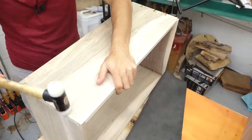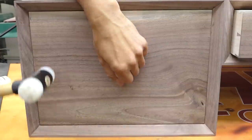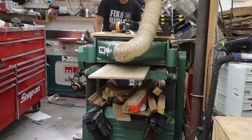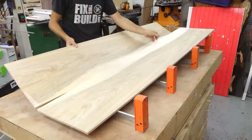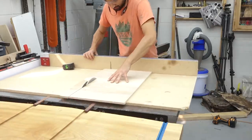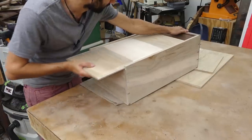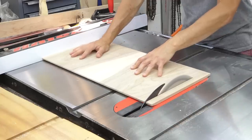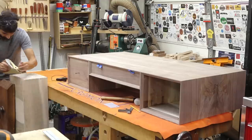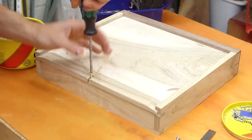Let's go ahead and glue these things up next. I'll get the glue applied and the drawer reassembled, and I can use the case as a clamping form so I can rack the drawer so the front ends up nice and parallel to the front of the case. Once the glue sets, I can pull the drawer and flush up the joinery. Next, I'll work on adding the bottoms. This starts by gluing up the panel which will be sliced up into the individual bottoms. I cut the bottoms sequentially, so not only are the drawer fronts continuous grain, so are their bottoms — because why not? Three sides of the bottoms are beveled, and then the bottoms can be slid into place. The bottoms will serve as the drawer stop, so I'll adjust them until the drawer stops at just the right point. Lastly, I'll cut a slot in the back so the bottom can be screwed to the drawer back.